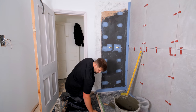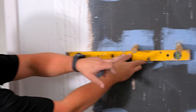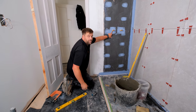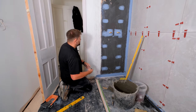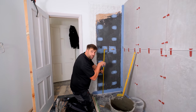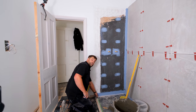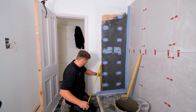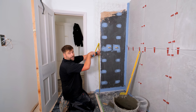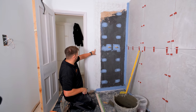And then give yourself a level line straight off the bottom of the pipes across, because it's much, much easier to do it rather than trying to do it underneath your pipe and trying to crunch your tape. If I show you. Trying to get your tape underneath here like this and trying to get a dimension is really difficult. So you can do it, strike your line across, get your tape off the bottom there, up to where the line is, so much easier. You can see exactly what's going on. So I know that's 1180, happy days, and that is to the bottom of my pipe.